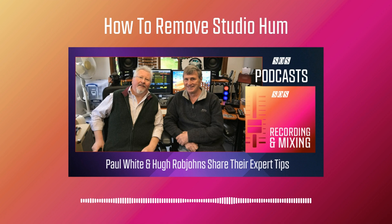So talking of tracking down: if we have a hum or buzz problem, what's the normal procedure? The first thing is to unplug everything and then plug things back in one by one, starting with the most critical elements. In a studio situation that's probably your computer and your interface — plug those in first, listen on headphones, make sure they sound clean. Then add your monitors and check again. Often you find a problem there because a desktop computer is grounded through its mains lead, and if you plug in active loudspeakers they're probably grounded too, so immediately you've got two mains earth connections and the potential for a loop.